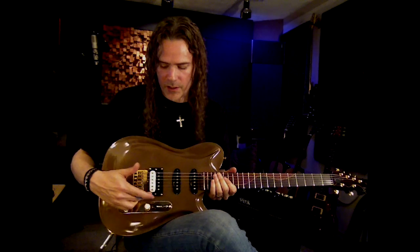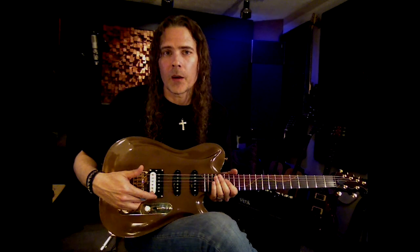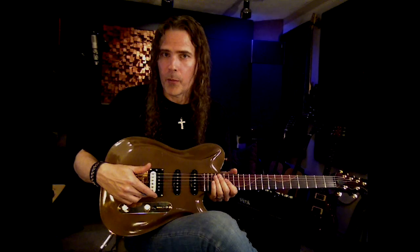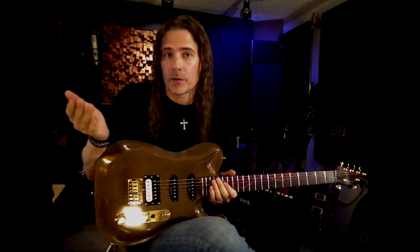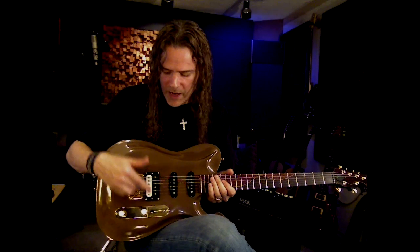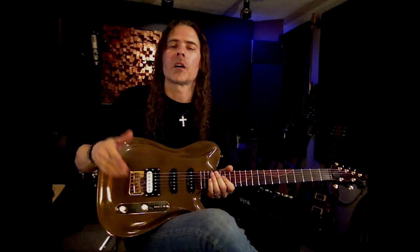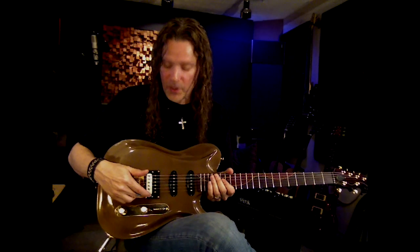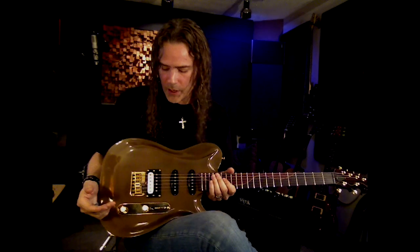and so that's what I've done here. This is about an 8K impedance pickup, kind of along the lines of the original Gibson PAF style, in that ballpark. Whereas a good distortion class pickup might be 10 to 12K or even higher in some cases. So we've backed that off. The magnets are Alnico. Alnico magnets, relative to ceramic or rare earth magnets, are lower output, but smooth tone. So I'm going after tone, not output here.